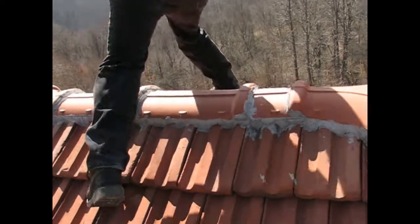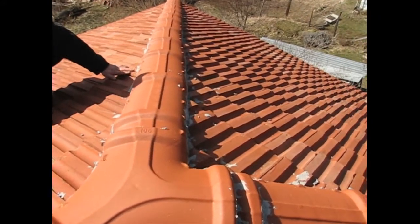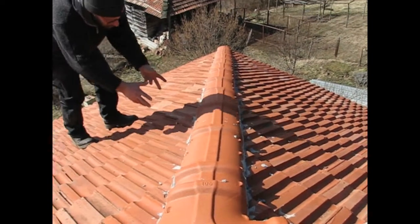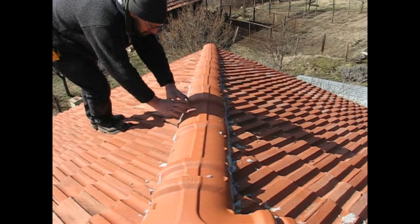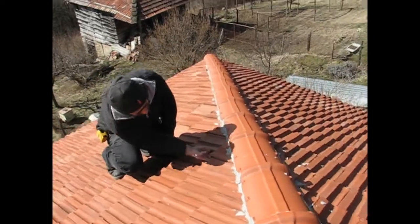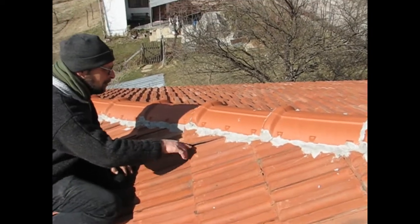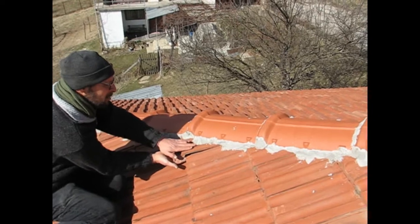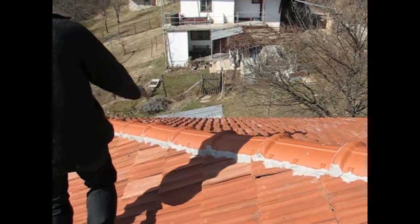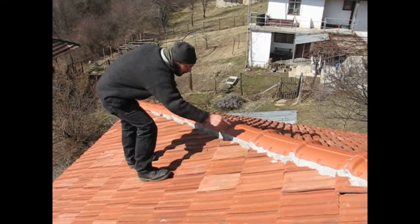Over here I've noticed this tile, for example. I come here and pay proper attention to it — I want to see why it's raised up. I understand why: it's a very short tile that's been cut and placed like that. But a good inspection of the next tile over tells me that it's a double channel. That means this tile comes all the way to cover the gap, so water can never come in — there are two channels on this tile running all the way underneath, and any water that comes from here will be taken down. No problems with that. I'll examine all tiles like that.